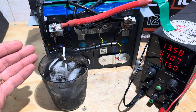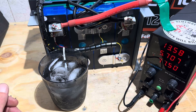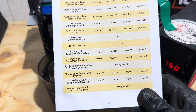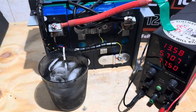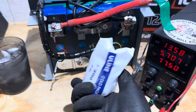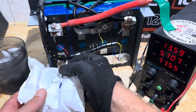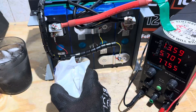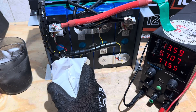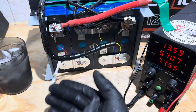Well, ice water's not doing it — that's three minutes in the ice water. That should have cut it off because they're claiming 32°F charging low temp protection — off at 32, on at 41. So that didn't work. Trying something colder: I've got a colder-than-ice salt-based ice pack, well below 32 degrees. I'll place it in the salt-based ice pack and count the time to see if it cuts off. That's two more minutes in the colder-than-ice pack. Nothing.